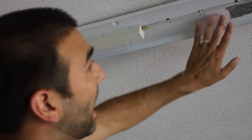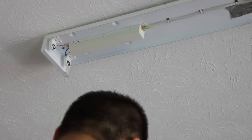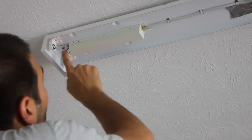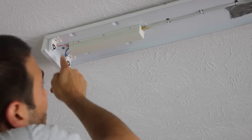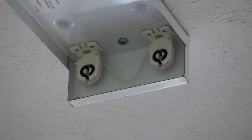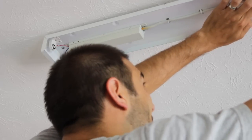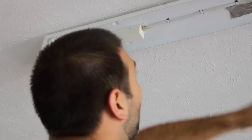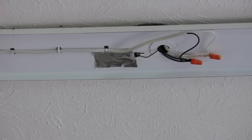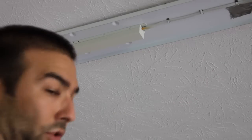If you're looking at the fixture here at the outlet, you'll see the ballast right here with lots of dirt on it of course. Two wires, one running to each of the two pieces, and on the other side which you can't see, there's a tether to this other line. Right here, if I were to peel off some of my heat resistant tape, you'll see the connections as they were tied originally. The fixture is grounded out and I've got two wires ran here.